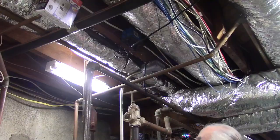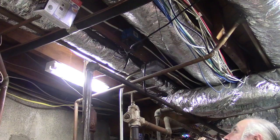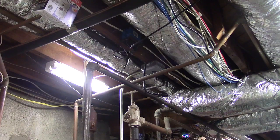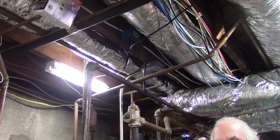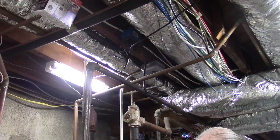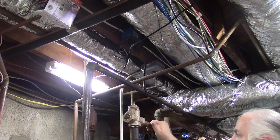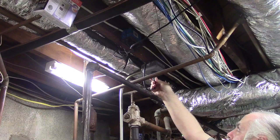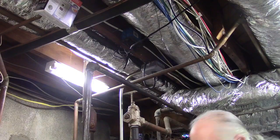The next thing I'd like to do is apply power to the boiler. Both thermostats are calling for heat right now, so what's going to happen is both circulator pumps are going to go on immediately. And there's going to be 2 clangs of the contactors. They happen at exactly the same time, so it's just louder. So let's do that first. One, two. Yes, they're running.